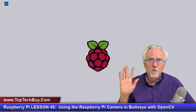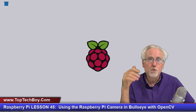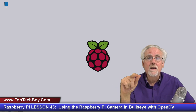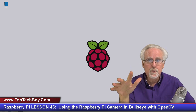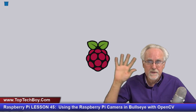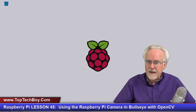Now, with that, we're booted up in the Bullseye system, and the first thing that we need to do is, the way that we're going to interact with the camera is through a library in Python called OpenCV. And so in order to do that, I will need you to install OpenCV on your Raspberry Pi. I'm going to show you how to do it, but you need to be on the same version of OpenCV as I am. And so if you've been already playing around with this and maybe you have OpenCV, flash a fresh card for this class and then do the OpenCV like I'm going to show you here.